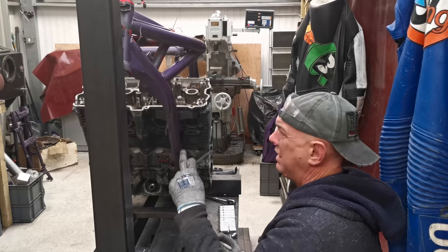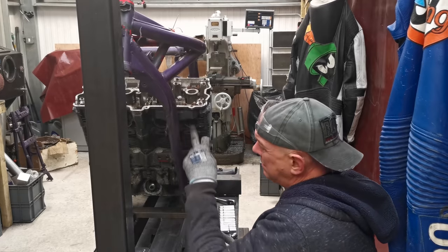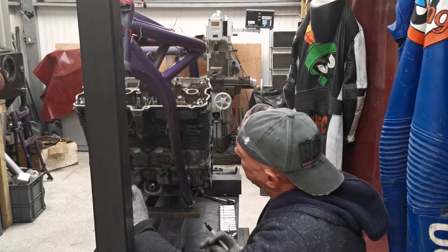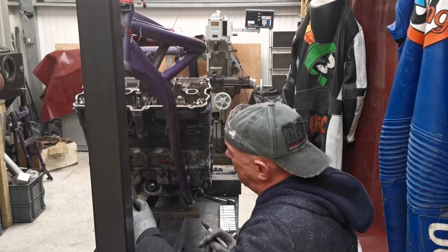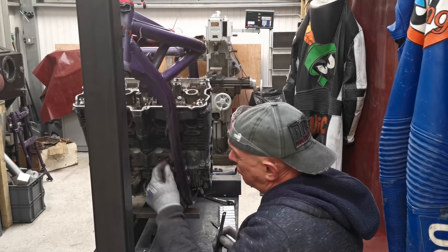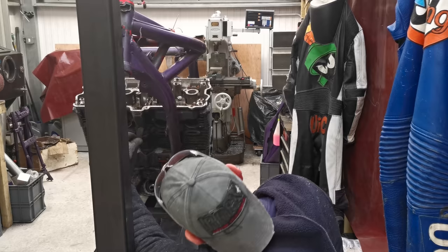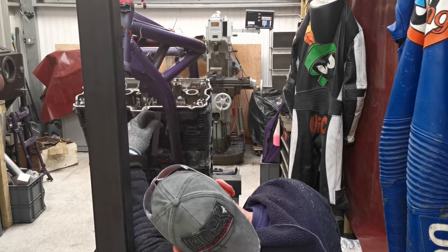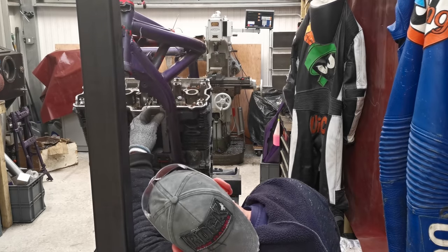And we've got a little kink in it because the tube comes down, it has to go between the two exhaust ports because obviously you've got headers come out either side. That could be an interesting bit because I'm not really sure how much clearance we've got, and there is this little dimple thing on the inside. And of course there would be a bracket welded right where I want to be.